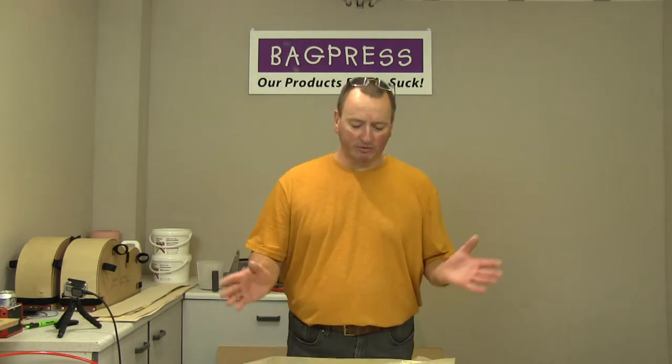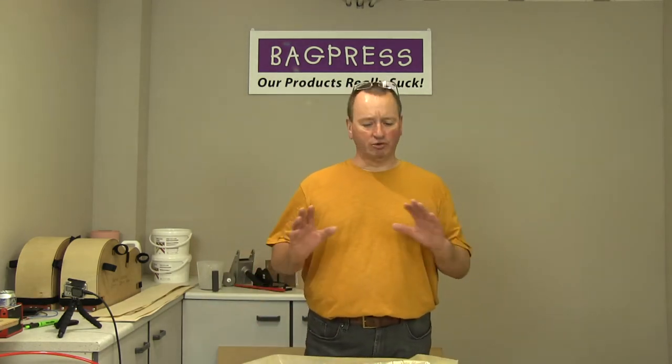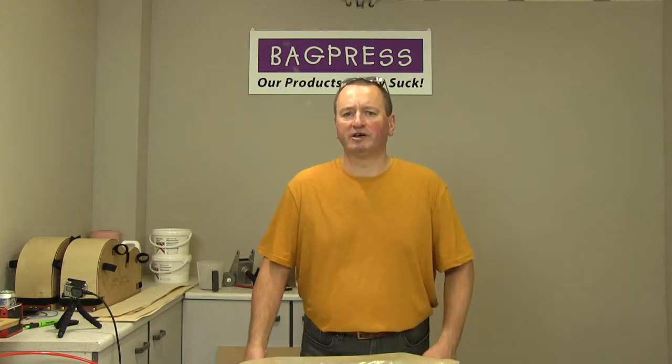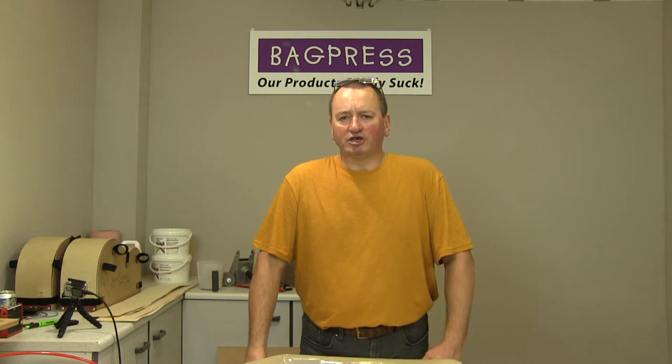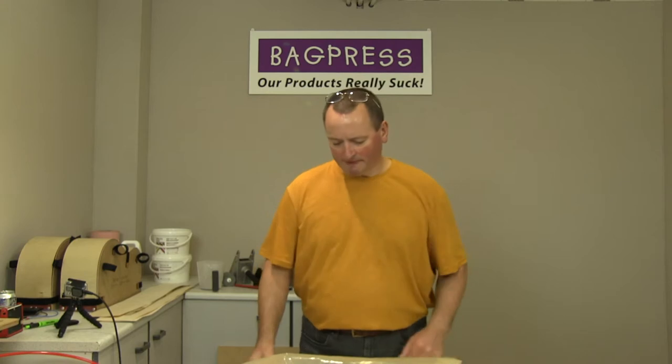So all in all, we do a lot of manufacturing using vacuum pressing, and all of our frame presses are fitted with box membranes. From a production point of view, it's by far the best system for the type of work that we're doing. Okay.